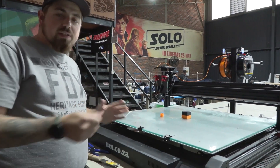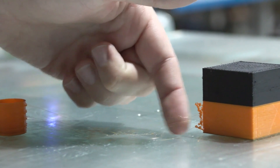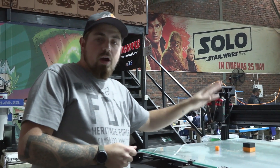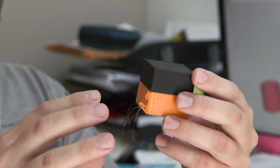The print is finished. Before I remove it from the bed, I want to point out an issue that occurred during printing. Between the purge tower and the actual object, we have some strings and a little bit of excess plastic. I know exactly what went wrong, so I'm going to remove this and go to a close up to explain. The print is now removed from the bed. The first problem is this excess plastic and the strings going to and from the purge tower — this is purely down to retraction settings.